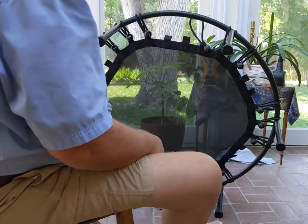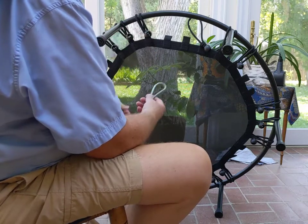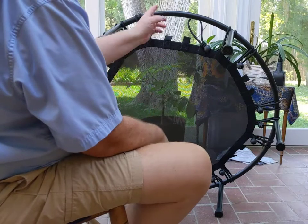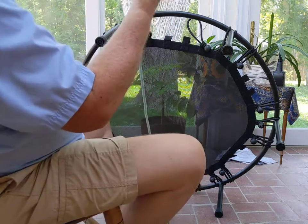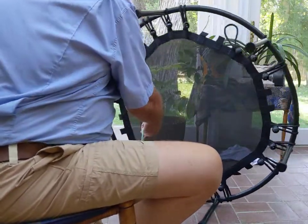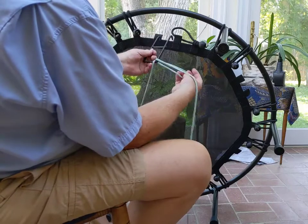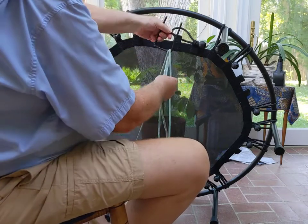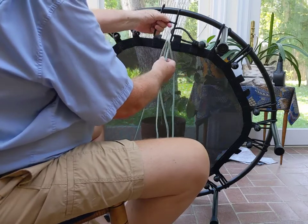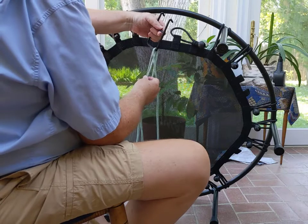I came up with something equivalent to a block and tackle. I have this nylon cord — some kind of synthetic, fairly hefty cord. I don't actually have a block and tackle, but there's plenty of smooth steel tubing here, so I can do a frictional block and tackle. I loop this over a leg down here and push it up, then come over like that — just loop it over. Right there I have a two-to-one advantage: by moving my hand a certain distance, the thing I'm pulling moves half as far. I have two strands to shorten, giving me a two-to-one mechanical advantage — I move a greater distance and get a greater force out of it.